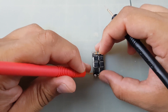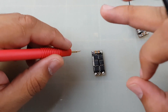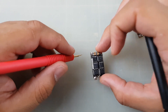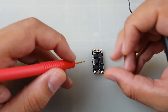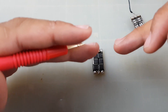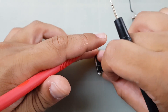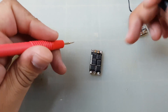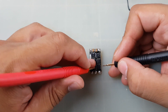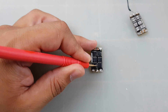I'm going to start with the middle pins — if the middle pins are bridged, I know I have a bad MOSFET. Something very important: make sure you have the ESC out of your quadcopter, because capacitors can get charged and the gate might open, making you think you have a bad MOSFET even though it's good. Keep shorting it out while it's disconnected to make sure everything is discharged — it was telling me four were bad when I had it inside the quadcopter, which I knew wasn't true.